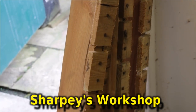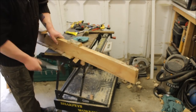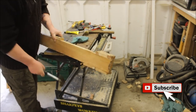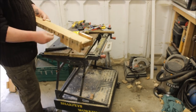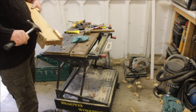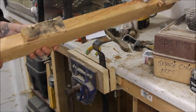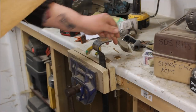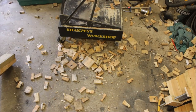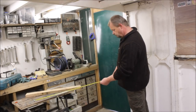Hello and welcome to my island workbench build. As usual I'll be building it out of pallet wood. I found it's easier just to cut through the slats, then knock the ends off, and then put the pry bar in the vise and use the pallet wood for leverage to pull the nails out. Of course there are many ways of stripping a pallet down. One that's never mentioned is jumping in the car, going to a local DIY store and buying some 3x2 before it's made into a pallet, but there's nothing like the sense of satisfaction when you've got some free wood and a load of mess to clean up.